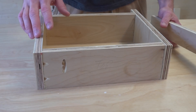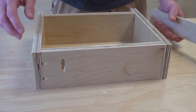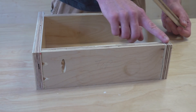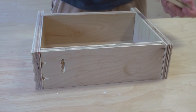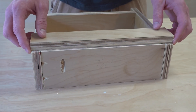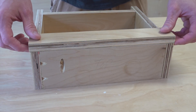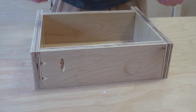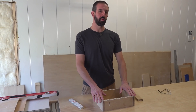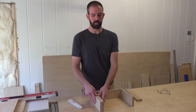Let me show you why. If you saw our earlier video, this is our miniature cabinet again — our top cabinet prototype — just so we can get a rough feel for our face frame. As you can see, when you final cut everything at the same time, you get a nice flush finish between all these boards, which will allow your face frame to sit on here perfectly so that you don't have any big gaps. It's a lot easier to do a final product that looks nice that way. So if you don't cut everything at once, you run the risk of having one board slightly higher than the other.